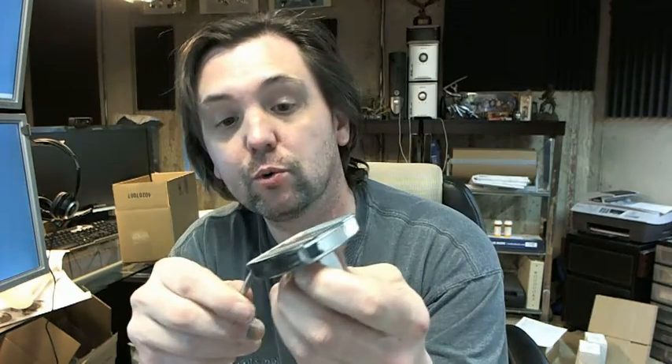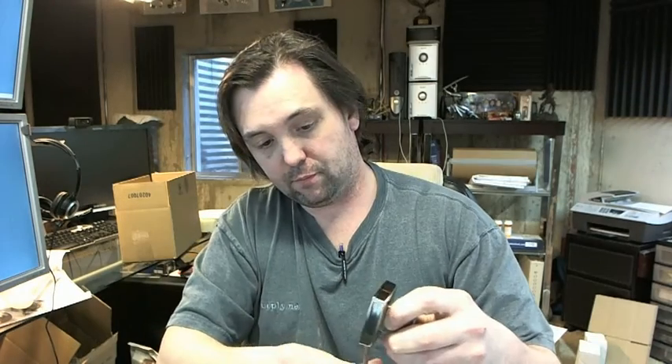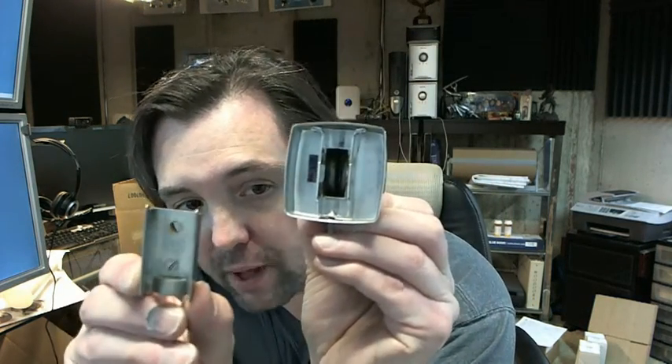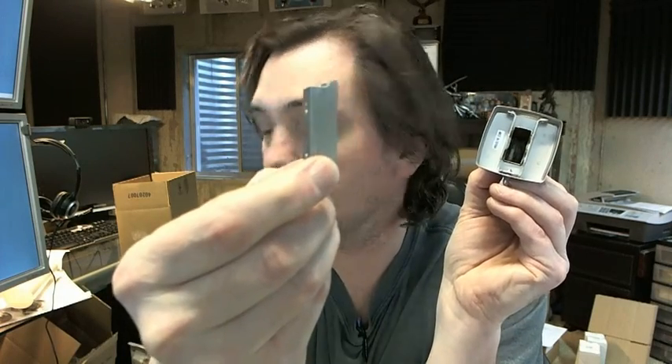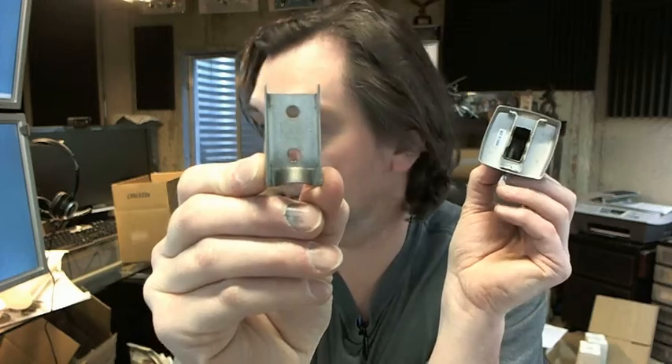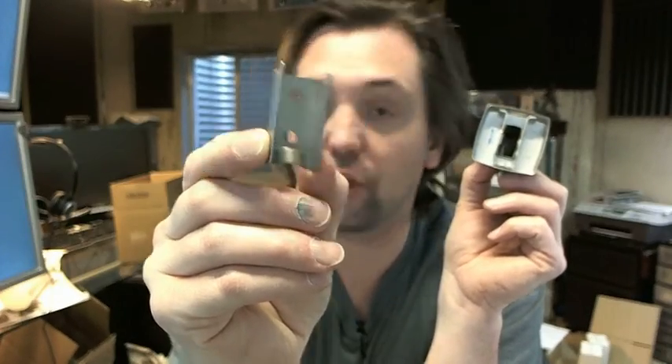Mounting is very simple — there's a wall plate and a set screw. I'm going to remove this set screw and show you the wall plate. That's the back side of it, and that's your wall plate that gets attached to the wall. In the cut sheet there's guidance regarding handicap compliance: from the finished floor to the top of the hook, 38 to 40 inches is your range.